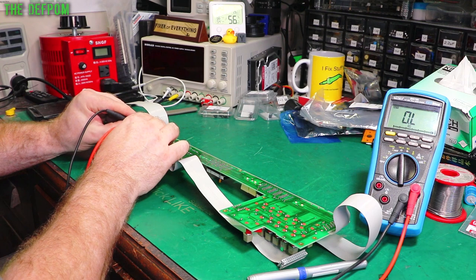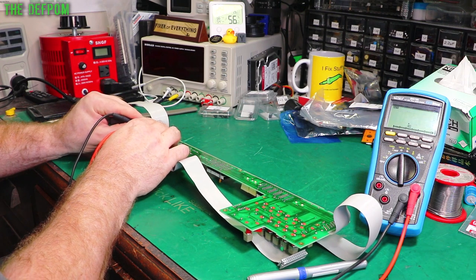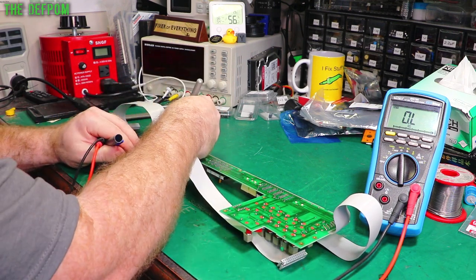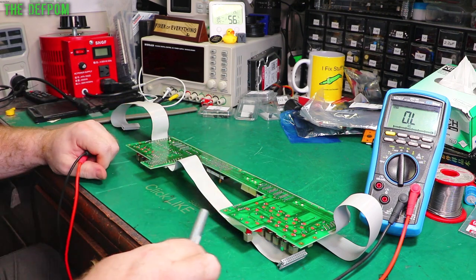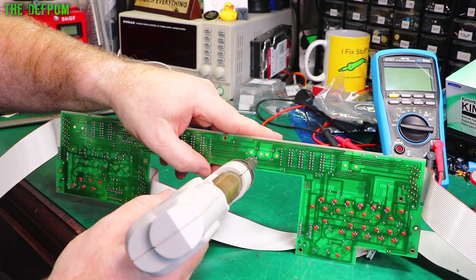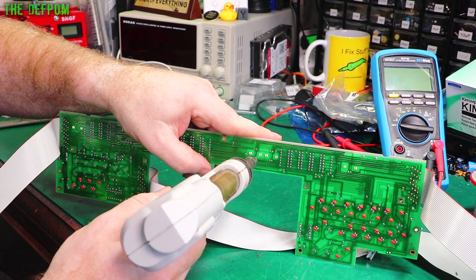We've got these two over here, 9.6 ohms, open, so that's one which also needs to be replaced, down there as well. So we've got two bulbs to do, which is great, that's nice and easy. So let's get these bulbs out, should be pretty easy hopefully. We'll see if we can do it with this without much else initially.